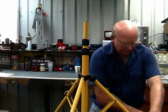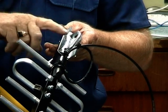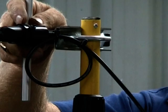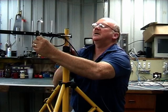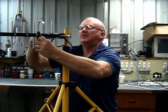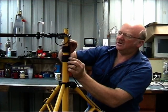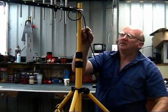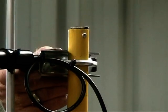Pick up your antenna. You've got your antenna and your clip on here. Make sure that this piece and this piece are on the right side. Mounting the antenna on the pole — just done like this. Make sure that the pole goes between this clamp and in here. Use your spanner and tighten up the nuts and just nip them up. Now your antenna is mounted on the pole. Remembering this little loop is still in place, and you bring the antenna cable down.